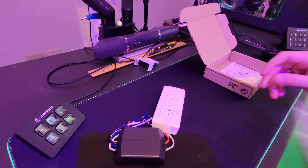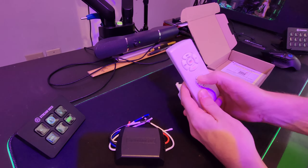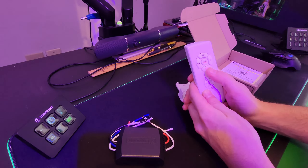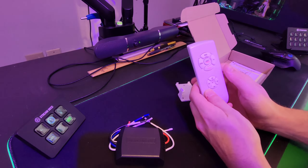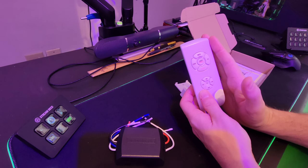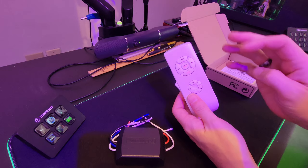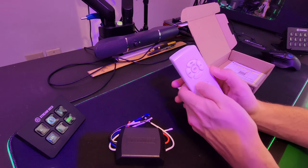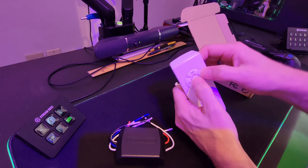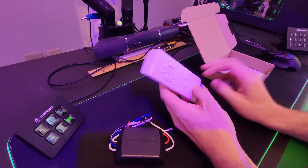What's included in the package: you've got a remote in a zip-lock bag that wasn't sealed, so there's that. The remote has a two-hour timer, one-hour, four-hour, and eight-hour timers, a light button, a dimmer, fan stop, and low, medium, and high speed. To pair the remote, first turn off the light switch so the fan has no power, then flick it on and hold the light button and high button for five seconds to program it to the module.